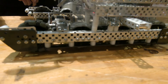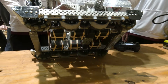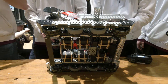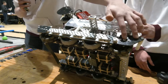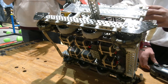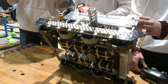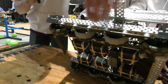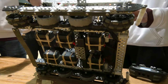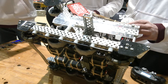But we also wanted lots of traction to get over the barrier, so we used these smaller 2.75-inch wheels in the center. Those are actually not contacting the ground when we're normally driving around the field, but they really help getting over the barrier. We also added sleds to help move over the barrier — front and rear sleds at a 45-degree angle, tangent to the profile of the wheel. That helps us get up on the barrier, and then we use a sheet of Delrin parallel to the ground so we don't grind the gears and we get over nice and smoothly. Instead of being perpendicular to the ground — which is a really small pressure point — having it on its side parallel to the ground evens out that pressure and makes it nice and smooth.